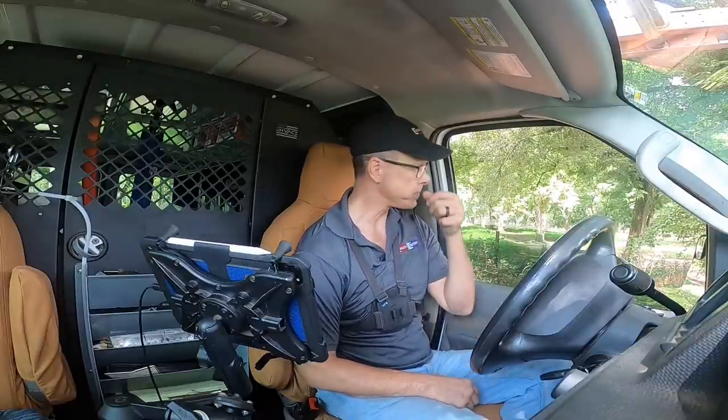I added leak stop because I thought possibly there might be a leak upstairs. It's hard to tell with that leak detector I've got, and I have two Schraders just pouring freon. I think those were my major problems. But it is on and cooling. In fact, it's doing really good. I got a nice temp drop on it.